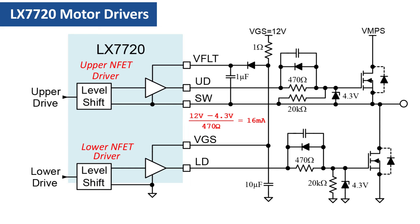Here's how that is calculated. A diode in parallel with the 470-ohm resistor ensures a fast NFET turn-off. However, turn-on is slowed down by the relatively high-resistance 470-ohm gate drive resistor. We can restore fast turn-on by fitting what's known as a speed-up capacitor across the 470-ohm resistor. The capacitance value is chosen to supply the NFET's initial gate charge and speed up the NFET's initial turn-on to its Miller plateau. The balancing speed-up capacitance, CSU, supplies the NFET's gate source charge QG.